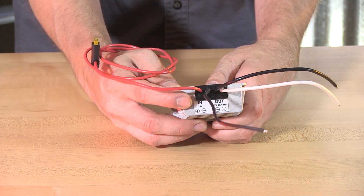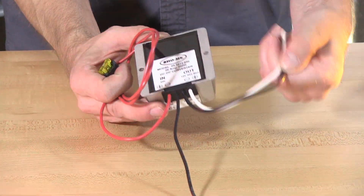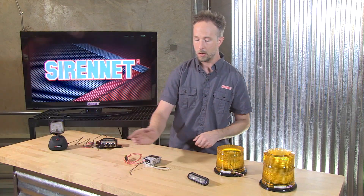Noted is your 24 volt — 20 amp with an inline fuse is what this is capable of handling — and the black and white, that's your regulated 12 volt output. So it's as simple as four wires: 24 volts goes into this, regulated 12 volts comes out of that output.